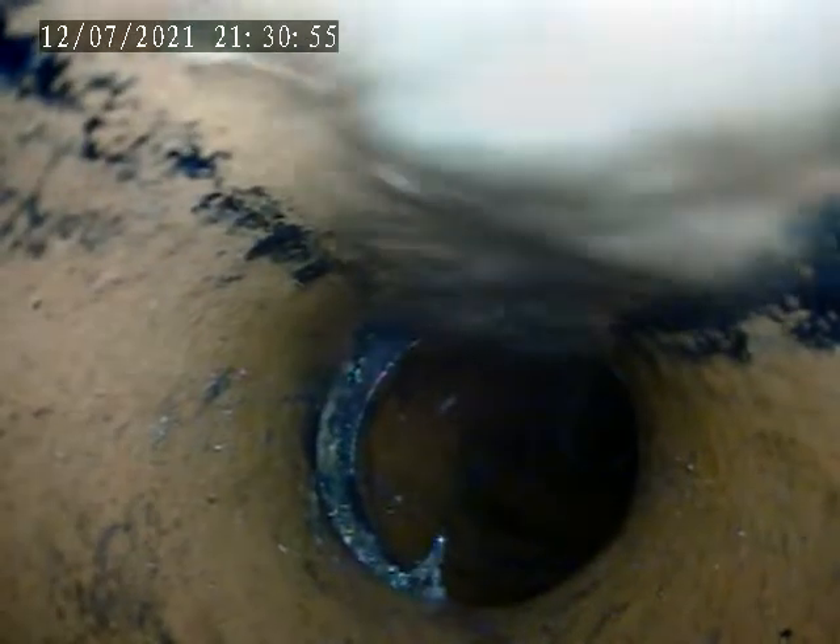So the root stuff is not under the house part, right? Actually, it is. So how does that get fixed? You'd have to dig it. Or we could line it — we could dig one section and put lining through it. This is where I hit the roots and it was clogging, right in this section here. There are a couple different ways of doing it. We could dig one hole and shoot the lining through, but it only gets part of it. Best way to do it is just replace it.